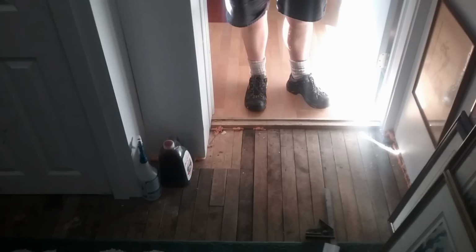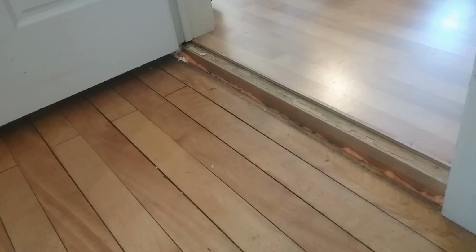This one is a little bit more complicated because there's a height difference of about 1.5 inches. And I have to make that in 2 pieces. So I'm going to make a plywood ramp and then glue the ramp down to the floor. And there's a big hump in the floor, which kind of makes it a little bit more complicated. So I have to sculpt that bottom piece around that hump. But both of the planes are pretty much even. There's not a variable.